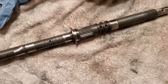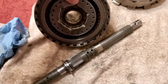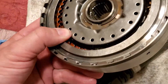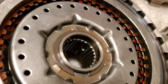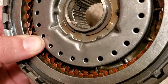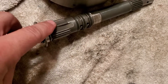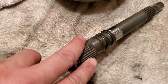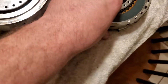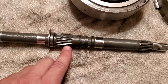One other very important thing I didn't realize: apparently there's not a master spline or anything like that on the shaft. There are three oil holes in here — one, two, and three — they've got little grooves which are almost like a master spline but not quite. Those three oil holes need to be lined up with the grooves here. There's one, two, and then the third one right here. They need to be lined up, otherwise the oil will never reach up here to the front clutch disc, and you'll end up burning it up because the oil can't get to where it needs to go to lubricate.